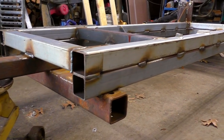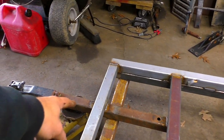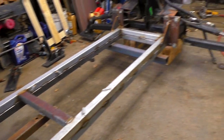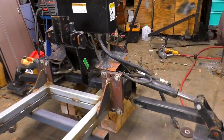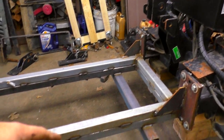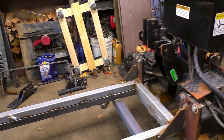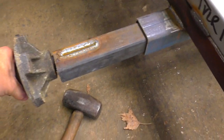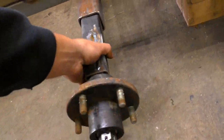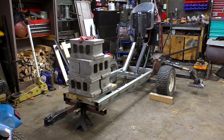I double-stacked that tubing all the way down. The tongue right here is another piece of this 2-inch tubing tied into this piece and the bottom axle piece, so that should be pretty strong. Got some quarter-inch gussets on the plates. I still have to cut a piece that comes down and then double-stack another pair of tubes coming across to tie the bar in. I also went ahead and got my axle tubes done so they slide in and out nice and easy — just have to drill and pin them — and then we'll have to match up a pin hole on the front axle.